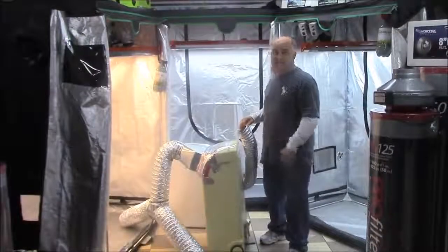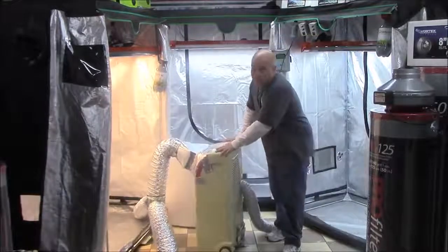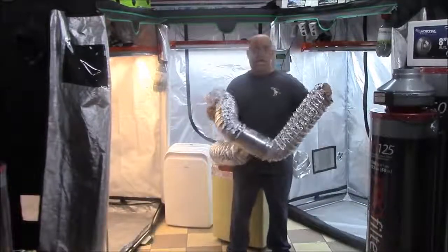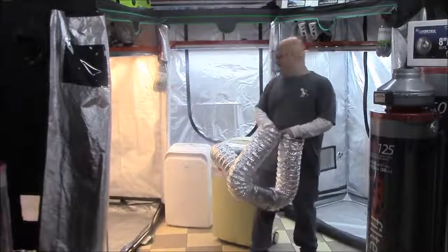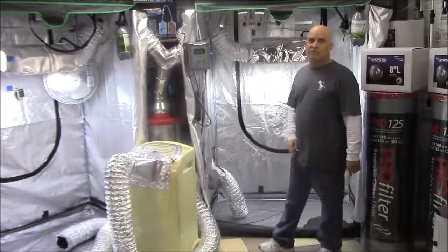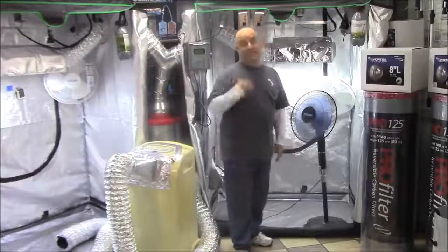You can use this one duct AC to cool a couple of tents in your garage or shed. Since you don't have to worry anymore about this one duct unit venting your 2500 watt house air conditioner, all you have to do is take the cold air it makes and blow it into a tent — just run this duct in wherever. In a garage where the AC is outside of the tent, this works great and you can get these things super cheap. Remember: push the cold air into the tent at the lowest point possible and vent from the highest point possible — because you want the cold air to have as long as possible to absorb the heat before it gets sucked into the hood and vented.